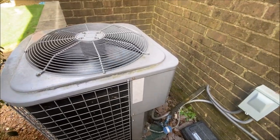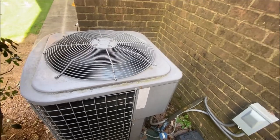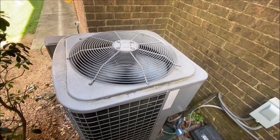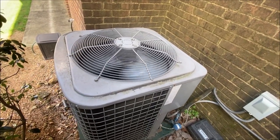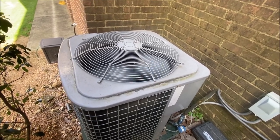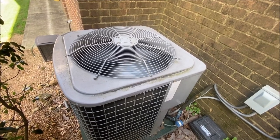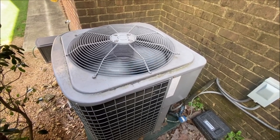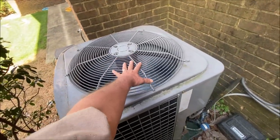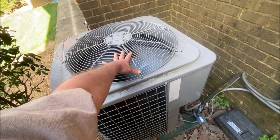All right. We got another machine over there on the other side that we saw when we were here in the rain that would not start. The compressor is giving the death buzz every couple of minutes. Tried a new capacitor, still wouldn't start. Definitely not dead shorted, but she was having a hard time getting going. This one is putting good warm air out pretty quickly. So I'm not going to do anything further to this right now.